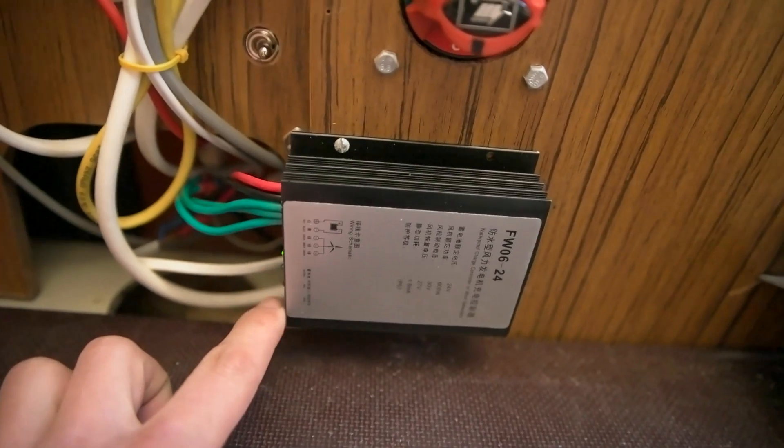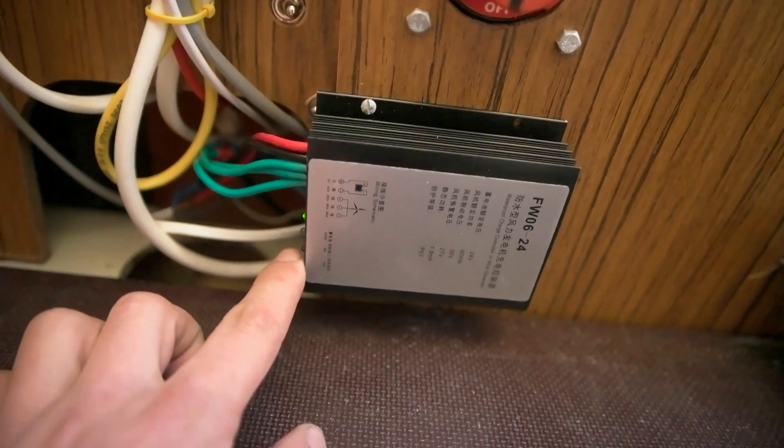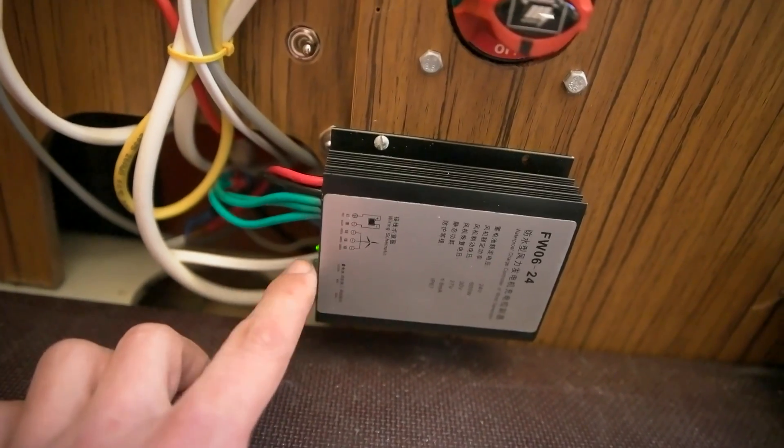This one is for the brake — I think it's gonna brake at some point if it's turning too much or the voltage is too high on the batteries. But that light doesn't blink at all. It might be that it requires much more wind than I expected. If it's only producing amps when the wind is like 20 knots, I'm probably gonna take it down because it's making a pretty big shadow on the panels, and I can see that from the voltages.